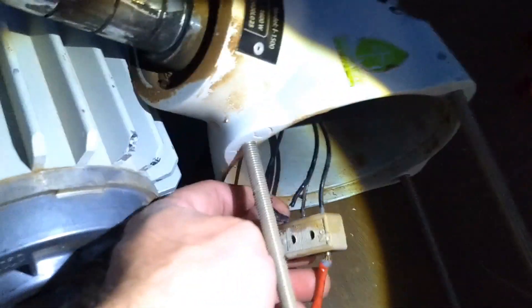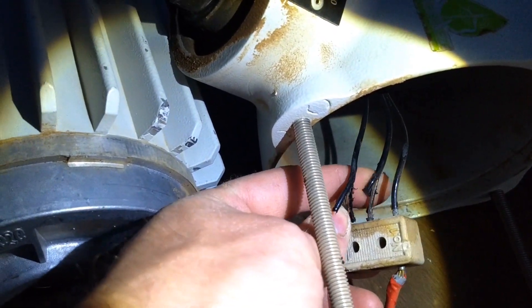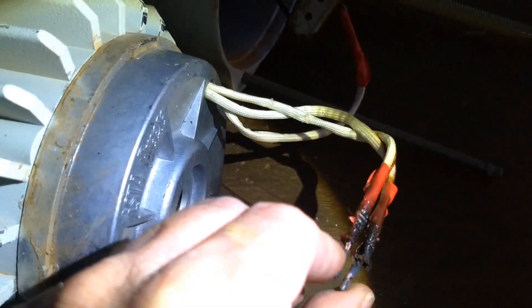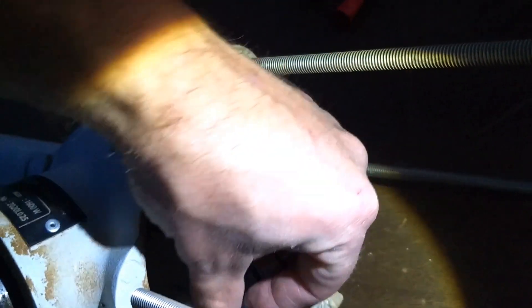Something that I have noticed over the last couple of weeks is a little bit of reduced output. And what I'm willing to bet happened is over here, this connection — because those wires were stuck together — they probably shorted out, but the turbine was still running. Most likely, this happened during that stint a couple of weeks ago where the wind was blowing 70 miles an hour. And it just progressively got worse and worse. Luckily, easy fix. I do wish that this was number 10 wire going back here, at least number 10, not this little stuff. This is a little bit smaller than 10.